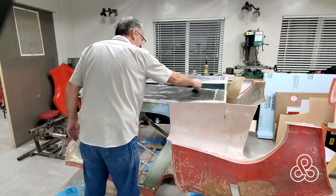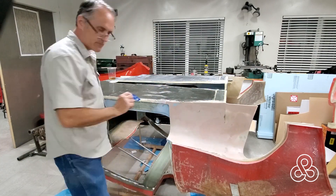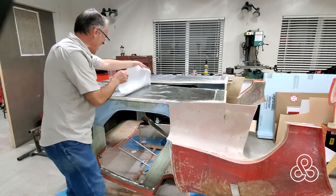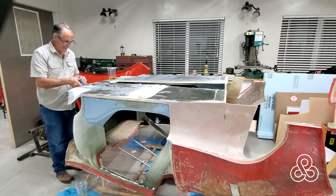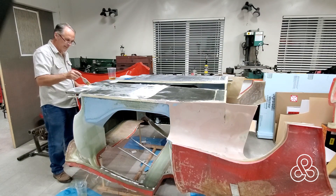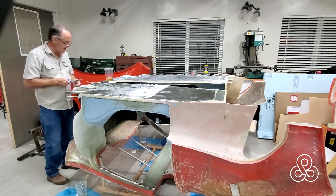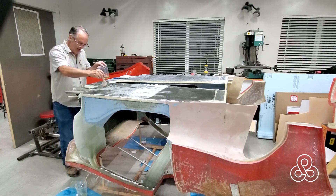There are sections in this floor that are thin where only the fiberglass will meet, and then we have one-inch-thick foam set up in kind of a grid pattern to add some strength. As we go back and forth laminating the bottom of the floor, we'll put a few layers on and those will lap over the edges and tie to the bulkheads and other parts of this whole tub construction. When we flip the thing over, we'll do a couple of layers on the inside of the floor to build up strength through the thin areas, and with the foam core, the same amount of layers but separated by that foam.